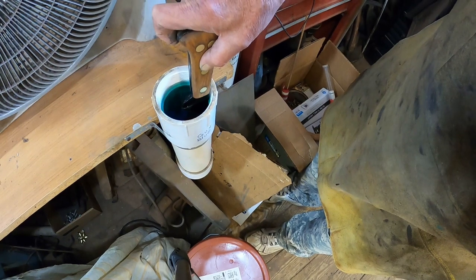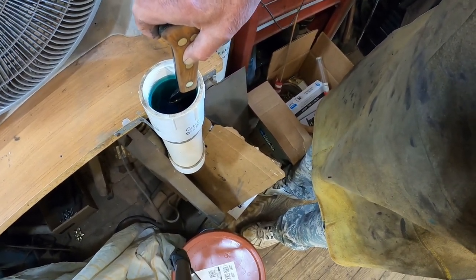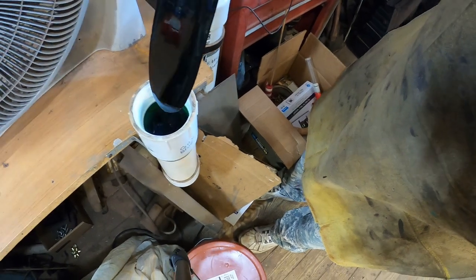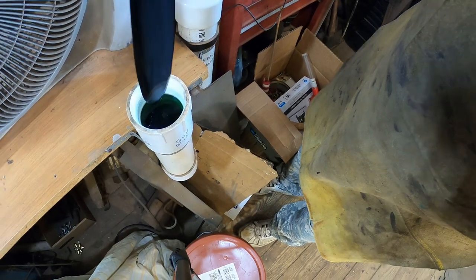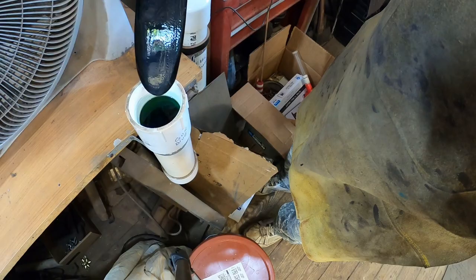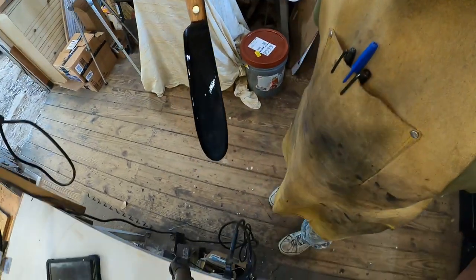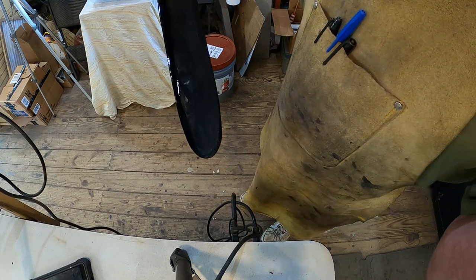It's what this gun blue actually does. It penetrates the steel. Turns it black, and it's a rust preventative, which keeps it from rusting. Oh, ain't that pretty. Now, you gotta sit 1 minute, according to the instructions. 1 minute, rinse it with cold water. Then do the same thing again. Clean it off again, do it one more time.